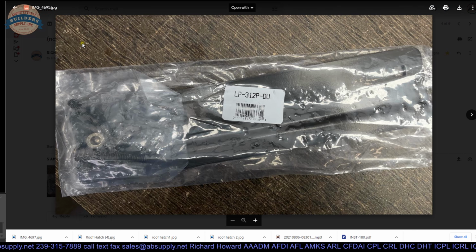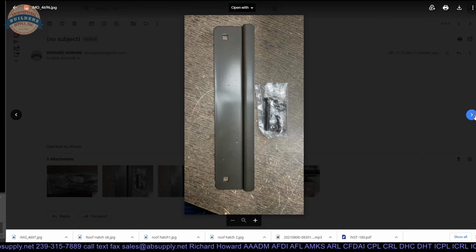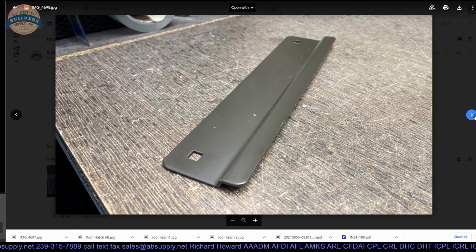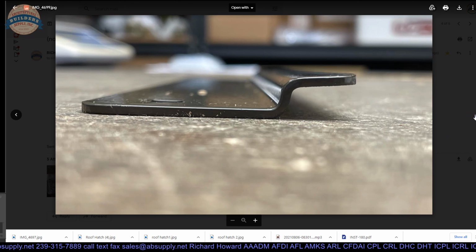Let's take a look at some actual photographs of the material. These are also linked or listed down below, showing the contents. Showing the offset. They show the offset at 3/8 of an inch. Sure, if you went from down here all the way to the top of this, yeah, you're going to be at 3/8. But we're showing an effective offset of about 9/32 of an inch.